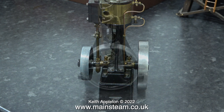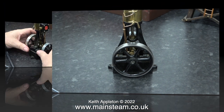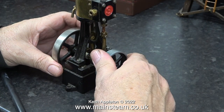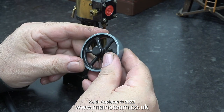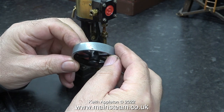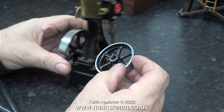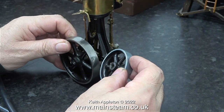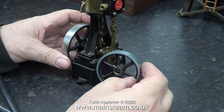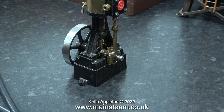I really hate the Mamod flywheel stuck on the other end of it as an afterthought. I've nothing against Mamod flywheels providing they are on a Mamod steam engine — stick one on a Stuart engine and it looks horrific. Things like this don't last long in my workshop, and here I'm removing it once and for all. Someone had taken the trouble to bore the centre out and then block up the other end. It is of course all a matter of personal taste, but this part is not compliant with my personal taste. The other flywheel is fine — it's cast iron, whereas the one I removed is made of an alloy. I quickly got rid of it and now instantly the engine looks a lot better.